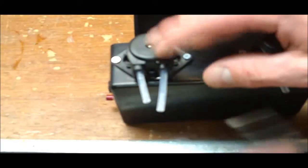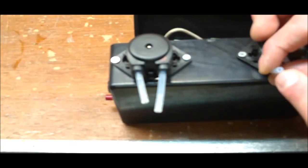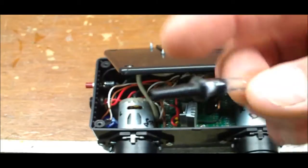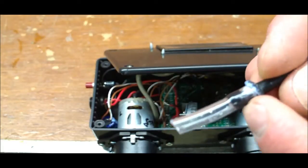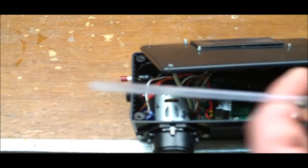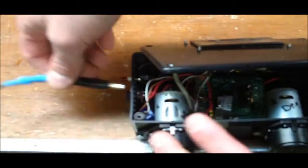When buying peristaltic pumps on eBay, try to find ones with connectors. The tubing is super thin — probably 1/16 to 1/8 inch inside diameter — and it's hard to find compatible tubing. I was able to make quarter-inch aquarium hose fittings work; one was an air stone fitting I could adapt for a tight but functional fit. I also picked up 1/8-inch rigid airline tubing to go down into the product container.